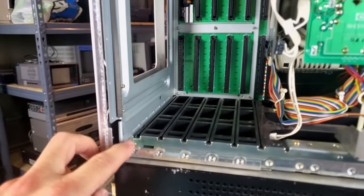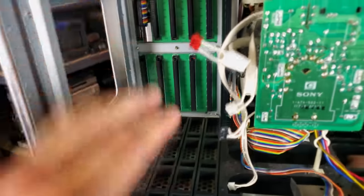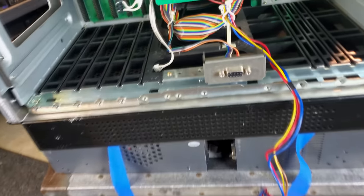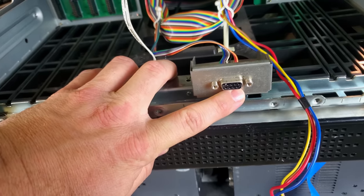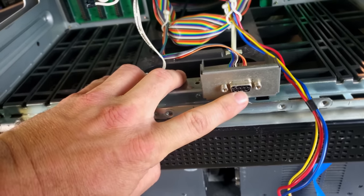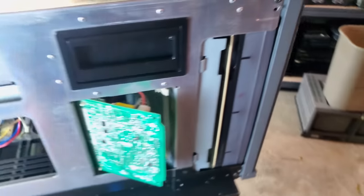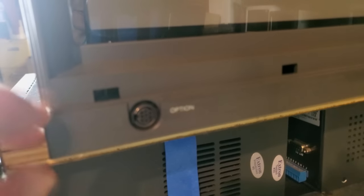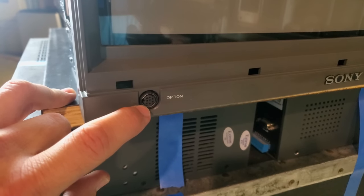For the ISR board, the main ISR board needs to go in this first slot right here, and the rest don't even need anything as long as you have your four primary boards. There's a connection point where you can connect your controller unit — either in the back with a nine-pin connection, or on the front side at the bottom of the bezel with a different eight-pin connector, which is the one I use.